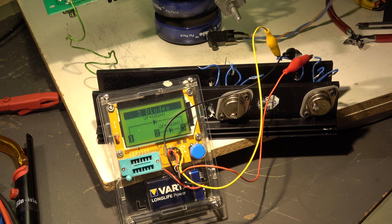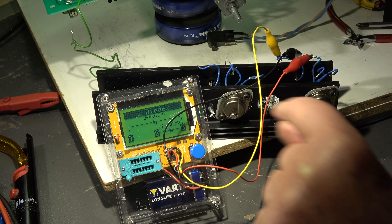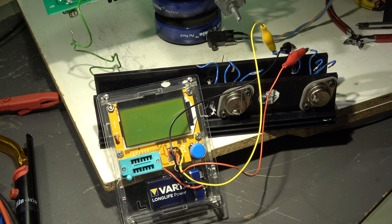Here we have diodes - also okay. Well, it's not functioning as a transistor. So I think three are bad, and the fourth one also has to go since I cannot identify the type and I want to have identical types in both channels. More or less all four transistors are bad, and this is the reason for the blown fuse - because two transistors on one side are more or less shorted, which causes a short on the power supply rail and blows the fuse on the primary.